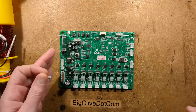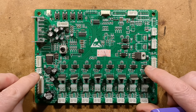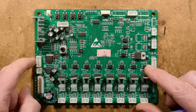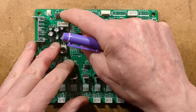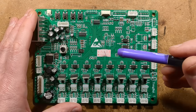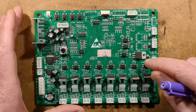No need for a close-up photo because it's so big. What we have here is the power connector: 5 volts, ground, 12 volts, ground, and 24 volts, ground. There's another 12-volt ground connection going out. We've got 12 volt, ground, 5 volts, and transmit and receive for serial communication. There are some buttons: enter, next, up, and down for changing the settings. Note the anti-static symbol — it came in ordinary bubble wrap, not anti-static packaging, which is really annoying because this circuit board was about £40. It didn't come with any data about the circuit board at all.